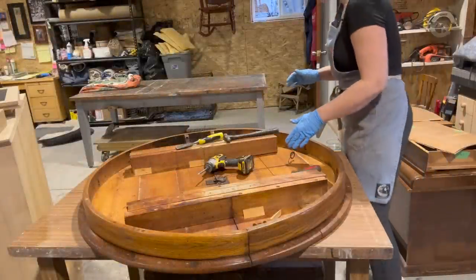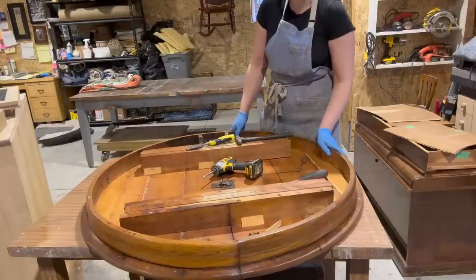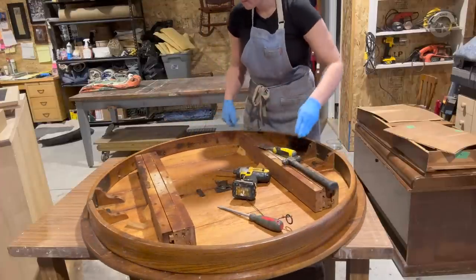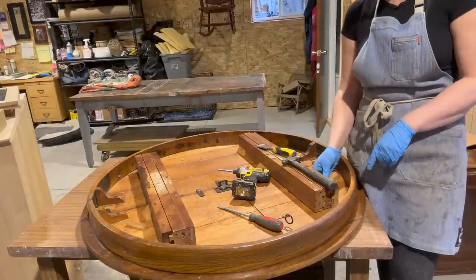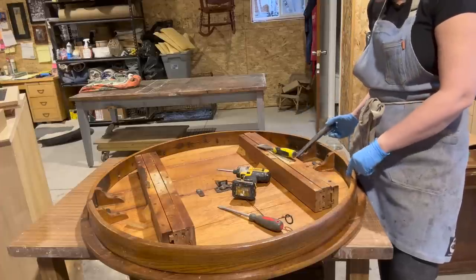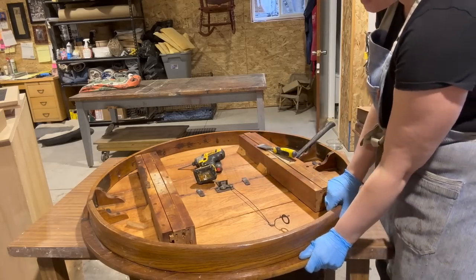I've got the leaf stripped, thought I'd start there. And now we can get onto this table. It's got a split along this whole side here. And everything else seems to be okay. So what I've done is taken out the corner blocks from the tracks to the piece, taking out this screw here, and then taking out a couple of the skirt screws. So I should be able to get this piece to slide out.